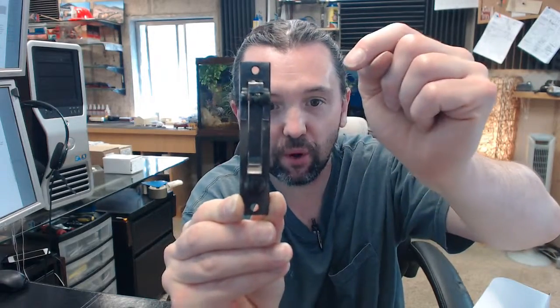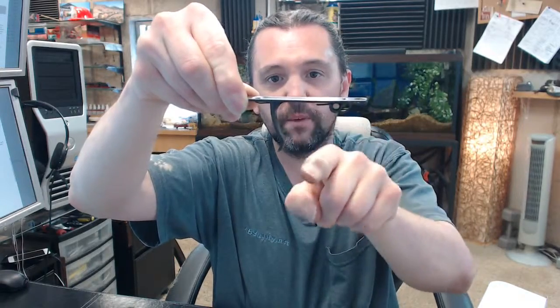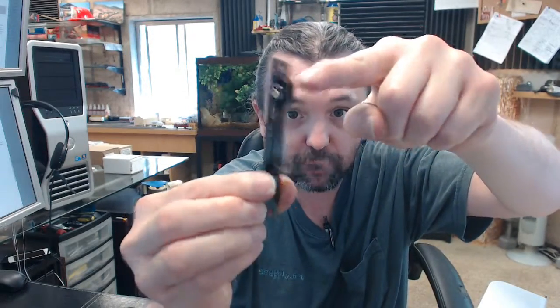I would come the width of the material, maybe the width of these springs, and I would use my plunge router and notch out my area here for this mechanism. And I would notch my route much deeper for everything else. Once I had the body fit, I would then take my router and mortise just for the plate, or the face of the unit. You'll have to do a little bit of cleaning out here because it's thicker up here because of the spring assembly than it is down here. But that would be the way to go with that. It gives you a really nice, tight margin.